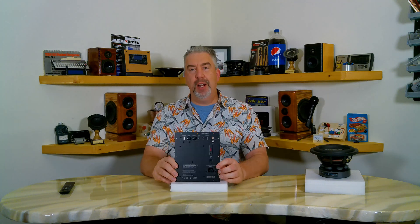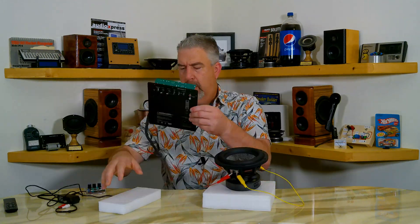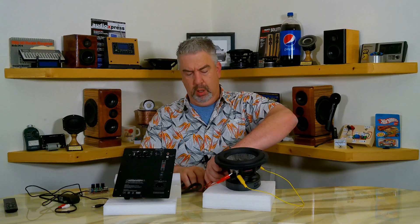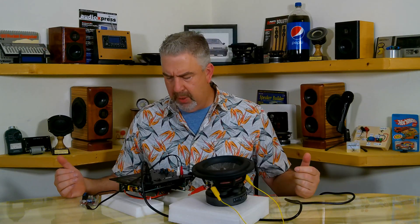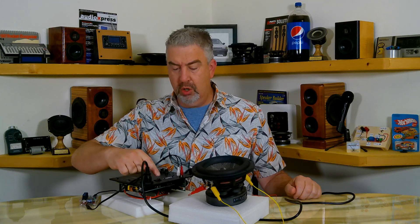Let's go back in time a few minutes and get the 7-inch EPIC driver and the SPA 300-D subwoofer amp out of the box and hooked up so we can see what the EPIC driver looks like in action. I'm using alligator clip wires to connect this, and since the EPIC subwoofer has dual 4-ohm voice coils, I'm running them in series to present an 8-ohm load to the amplifier. Alright, I think my hookups are good — let me turn the volume down and turn the amp on.